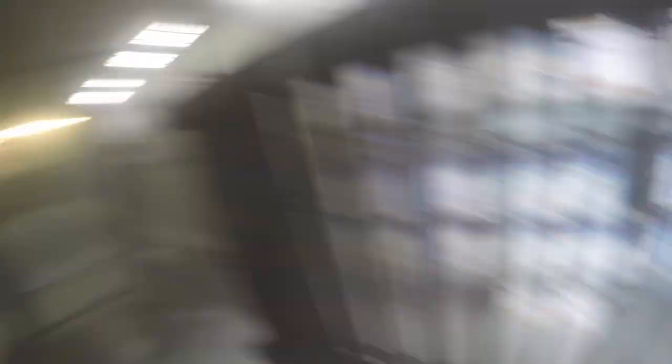This is the satin black going over it now. I prefer doing the top coat mainly because the sandblasted steel looks exactly like the zinc coat, so it's hard to tell where the powder coat is compared to where it's raw — whereas black over the gray is a lot easier. After a while it can get a bit monotonous, but one thing I've been listening to: if you're powder coating for a while you should check out the Fast Life Podcast — they chat about motorbikes, painting motorbikes, and motorbike helmets.